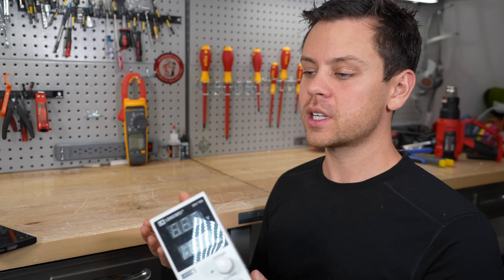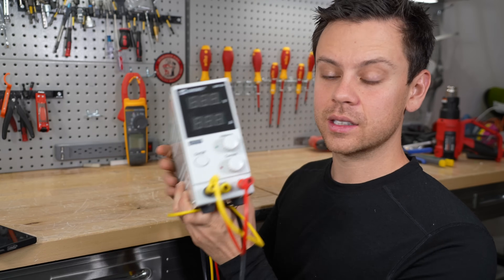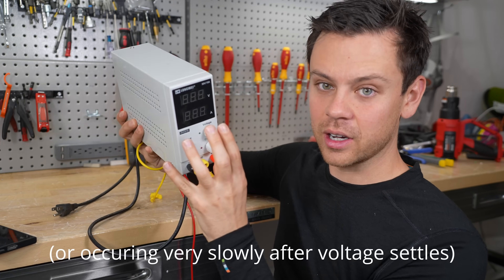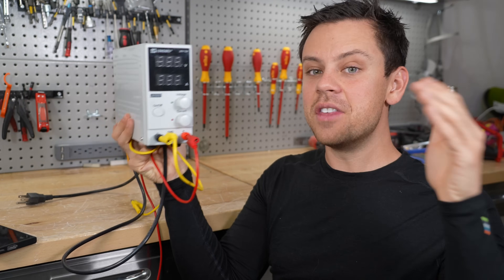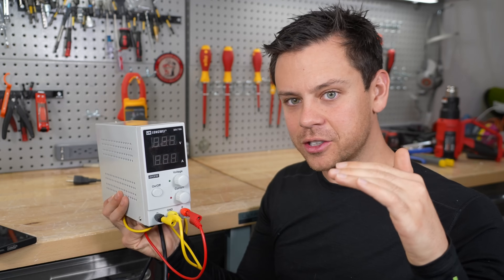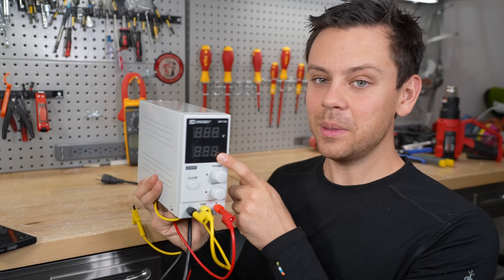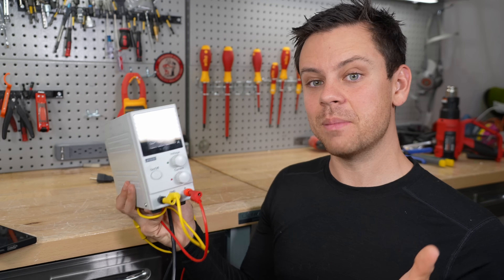With cheaper batteries, you need to keep cycling to 100% — it can be quite difficult sometimes. If you don't want to wait, or if your 14.5 volt charger keeps hitting that high voltage disconnect and you're waiting for it to cycle and balance slowly, you can use a power supply and watch the current slowly drop as you get to a higher state of charge. You can lower the current down to whatever the balance current is, and it will slowly rise the voltage to 14.5, and then you'll get a disconnect. When I do my capacity tests, I use this so I know exactly what the state of charge really is. If I'm at 14.2 volts and hit high voltage disconnect, that means I need to balance the cells. If the cells are matched nicely and I hit 14.5 volts and it just cuts off, then I know it's a higher quality pack and they actually matched the cells properly.